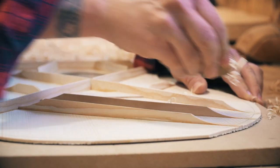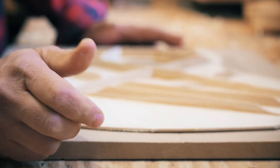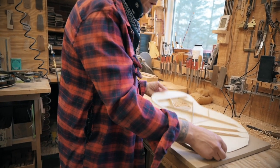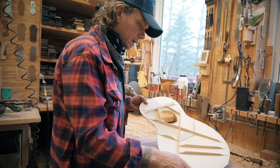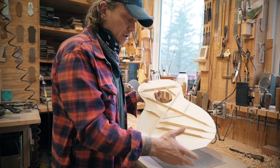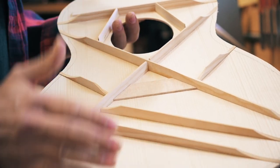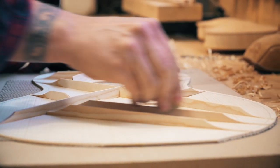This is a typical early 30s bracing pattern. Right now we've glued these on with hot hide glue, kind of a rough shape, and we're just going to fine-tune the graduations — number one for the edges to kind of meet the rims and meet up with the rest of the body. This is one of the more critical points of building a guitar: making a judgment on how stiff this wood is, the weight, the thicknesses, and how it all vibrates.